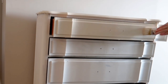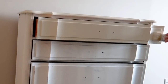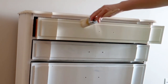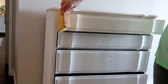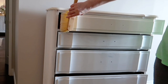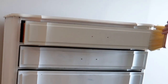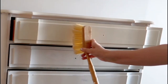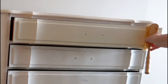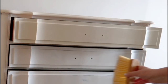I'm trying to create a faux white oak look using the chalk paint. I'm going to continue loading up the paint and make sure the surface is completely covered. Once satisfied, I'm going to take an inexpensive brush — I got this from the dollar store — and very gently drag it across the dresser with very little pressure, just a light sweeping motion. This will lift some of the paint, and the finish this technique gives you is amazing.